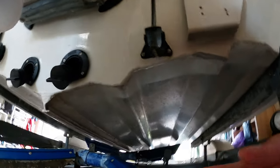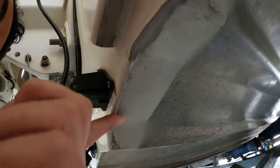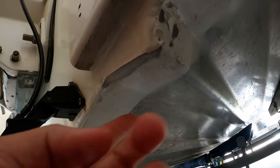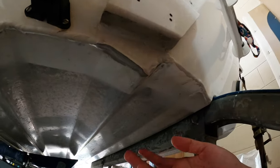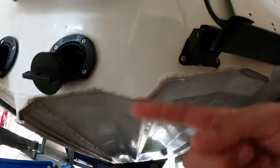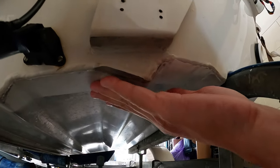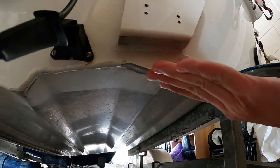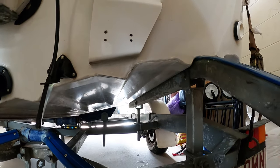Here under the welds - if you have an aluminium boat, they have these welds where the two plates meet. It's always a good tip to file that off so it's nice and smooth. Where the transducer is mounted, it's been filed off so it's nice and smooth. When the water comes through it doesn't hit that weld and create bubbles and turbulence, because your transducer picks up all those bubbles and it becomes disastrous chaos on your sounder. Filing creates a nice smooth flow of water through and will definitely be more beneficial for your sounder.